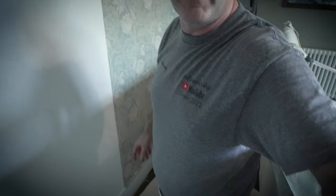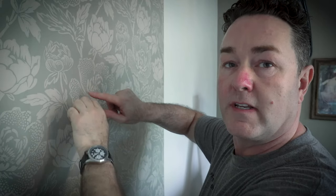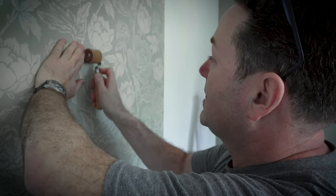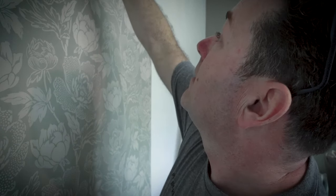My battery died for a moment there. Anyway, I've got it cut at the top and I'm just trimming the bottom. I've got it lined up nicely at eye level on the next length. All in all we're cutting nicely at the bottom — trimmed off so we haven't got too much waste. Here we are at eye level: you can see the pattern there. I'm working on these joints, just pushing down with the seam roller making sure it's nice. If you've over-soaked it they'll pull and stretch back when it dries — that's the nature of the paper. Just gently wipe any joints in case there's paste that's oozed out. At the moment you'll see the joints because it's a wet edge from where the sponge has been, but other than that it's not bad at all. I'm quite happy. Make sure there's no air bubbles.